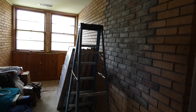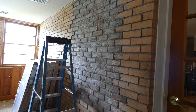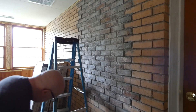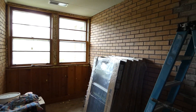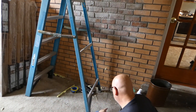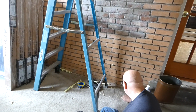This started yesterday with us scrubbing the brick with wire brushes and then Scott was vacuuming — you saw that clip just a minute ago. Well, then that project expanded and all of a sudden all the trim's off the window. He was poking back in the mortar joint to see if that was sealed up, and apparently it goes all the way back into the cavity of the wall.